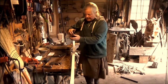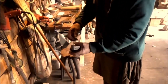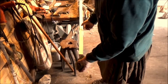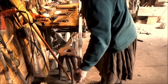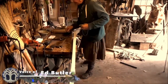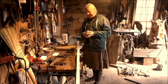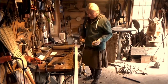What that will allow us to do, because the stave isn't exactly straight as a sawn board would be, as the string shows, is take a little bit off the fatter sides and straighten it out a bit. So ultimately the bow comes out straight, up and down. It's not going to be perfectly straight, but that's the beauty of these kind of bows, they don't have to be perfectly straight. Yeah, it's not a fiberglass longbow.